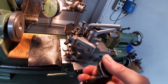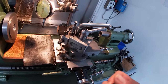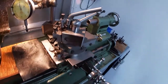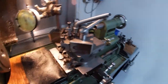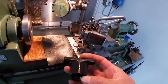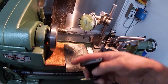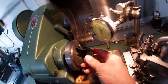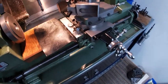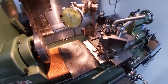This is what you get, and as I've explained it's not fantastic, and getting rid of the backlash is a problem. I know people use spring washers and all sorts of things but you can end up putting a lot of friction and wear on the part. So this is my prototype part. What I did was to mount a spare one of these on a faceplate using this surface here, so it sat on the lathe. And I bored out all the bits in the middle — all of those bits I wasn't really happy with — and I made an insert.